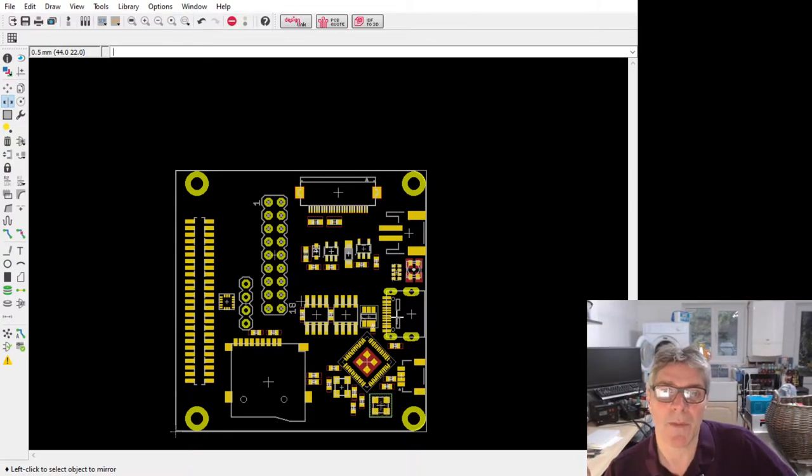Now it could either do that by piping it to the STM32, or it could actually talk to the gateway in the FPGA, which then reprograms the flash itself, depending whether you want it to reprogram the FPGA live or whether you want to reprogram the flash and then have the FPGA reboot, effectively. So it gives us all that option and it enables us to use some of the work that I was doing before with Alloy, etc.